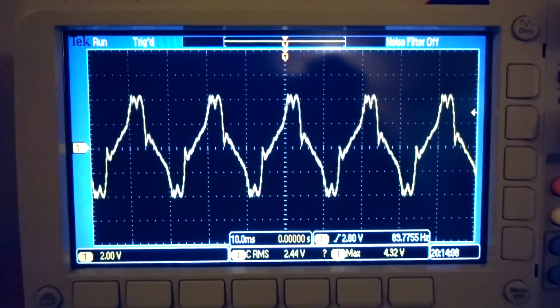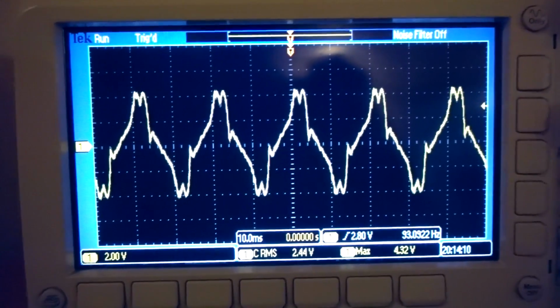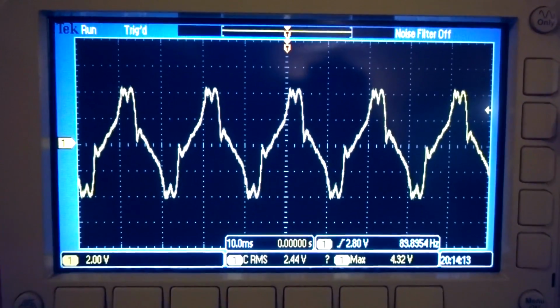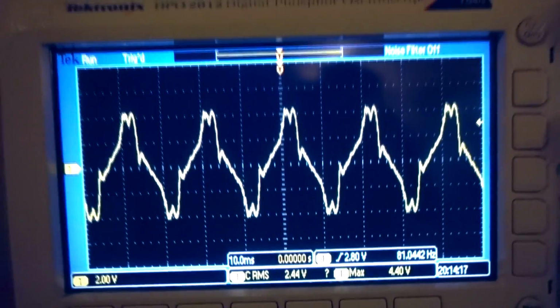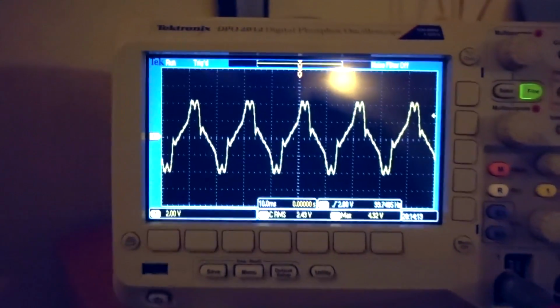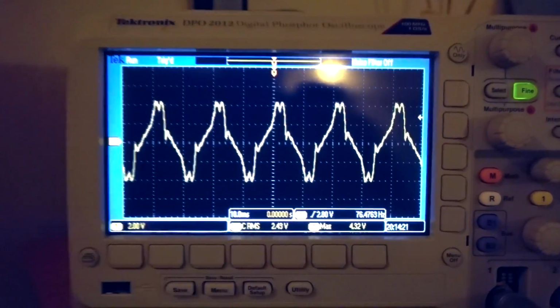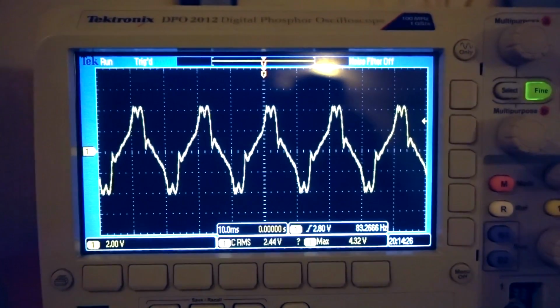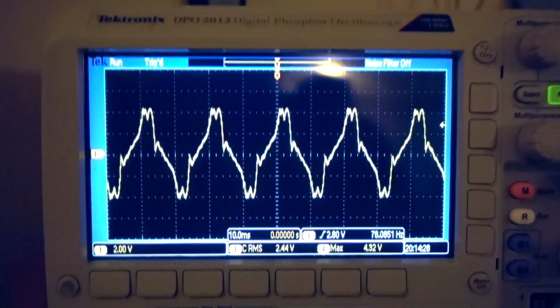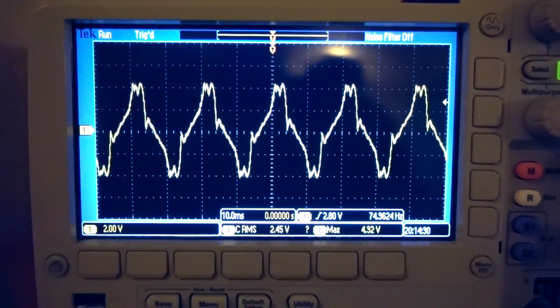We had been assuming all along that mains would be a sine wave. In every textbook and example you see concerning the mains, you almost always see a sine wave, but this is not a sine wave. And that is exactly where our problem is. If it's not a sine wave, you can't just capture the peaks like that. You're not going to get a correct value. You need some way of calculating the actual RMS, and this is exactly our problem.